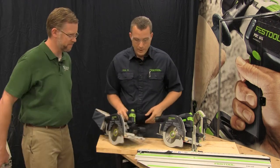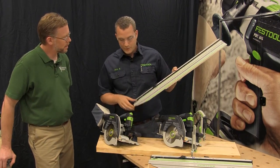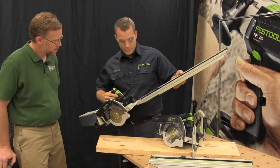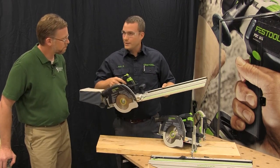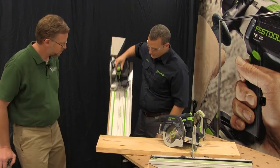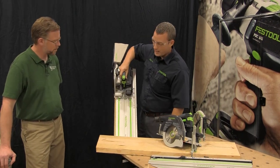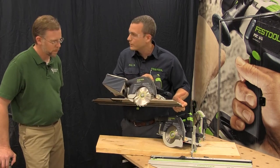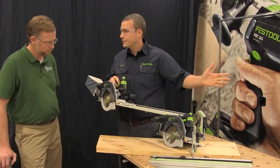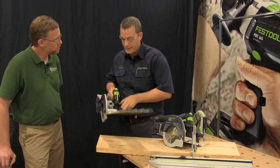This is a different approach to a guide rail for us, in that this one actually attaches to the machine using a T-slot. It can hold in place not only here, but when I tip it this way. So if I'm working in this type of plane, the guide rail is going to stay attached and retract automatically. As I made that cut, you can see how it swung the guard out of the way, and then the guide rail retracts on its own, so it always allows me to work consistently and safely.